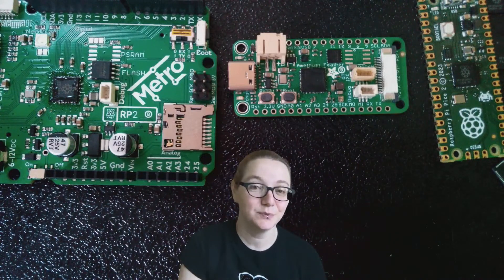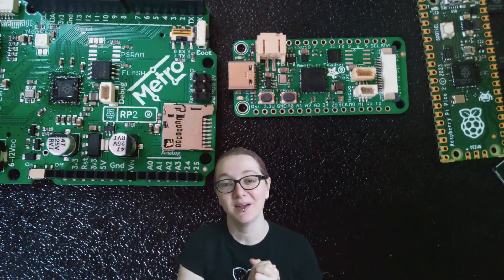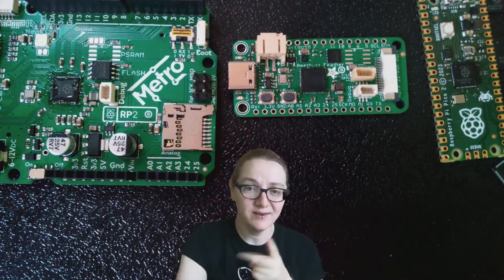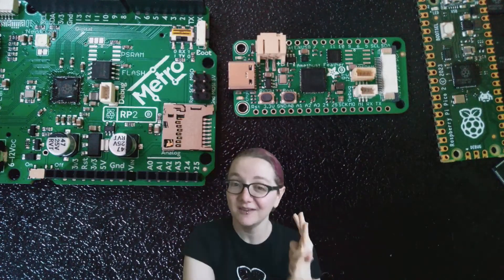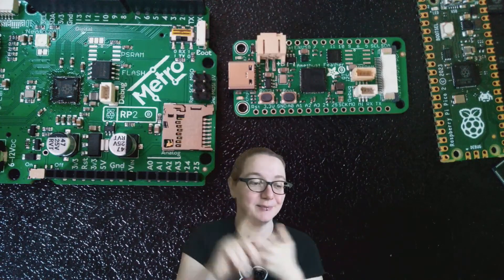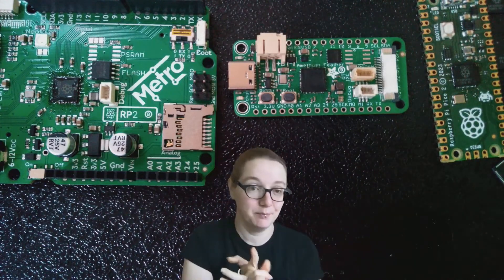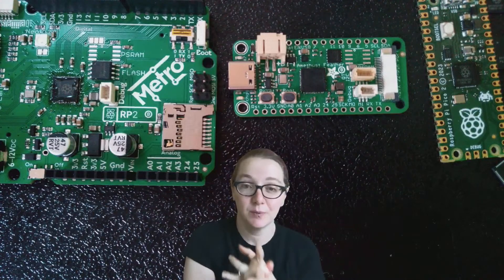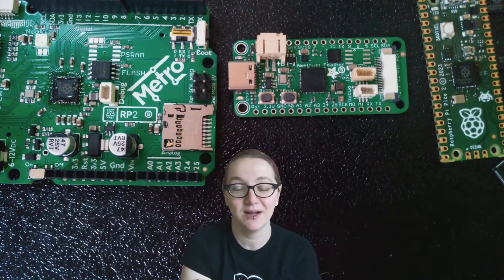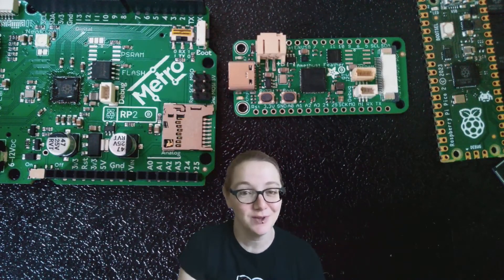This just dropped! I know Scott is also going to be doing a deep dive on Friday if you want to learn more about the internals of how CircuitPython was ported to the RP2350. I love new chips — it's exciting. Twice as fast, twice the RAM, more flash on the Pico 2, HSTX, peripheral PSRAM support, RISC-V cores, M33, better low power support coming, better security TrustZone support for those who want to put the 2350 chip in products — a really great upgrade to the 2040. You're going to see it in a bunch of new Adafruit products. Put any requests in the comments. Thanks everybody!